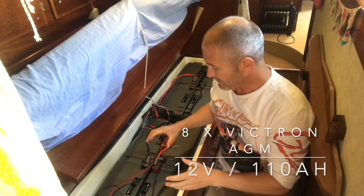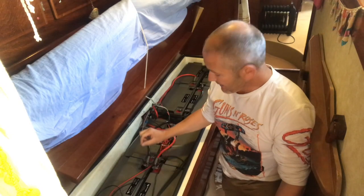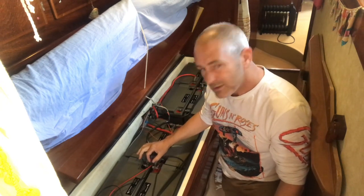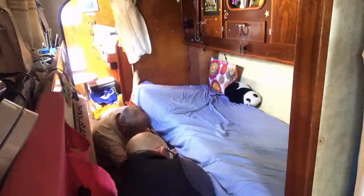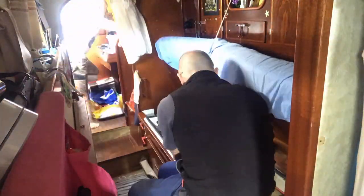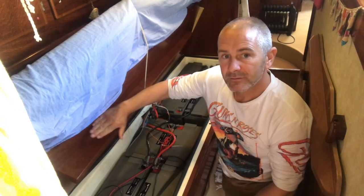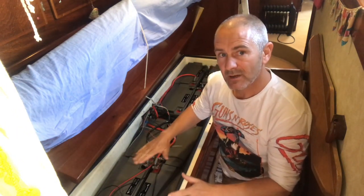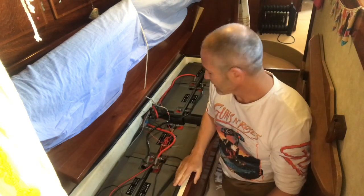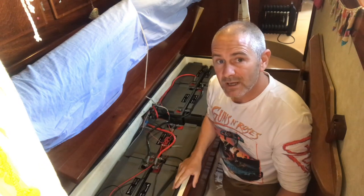But of course what looks good on paper always rubs up against the harsh reality of boat design. We spent about two hours trying to swap these batteries out, putting them in the same way they came out, thinking they were more or less the same dimensions. But they're slightly bigger and the terminals are closer together — only about two centimeters between them — which is not brilliant because if the boat shakes and those terminals arc, we've got a potential fire. Also because of the slight difference in dimensions, some cables were running over the terminals and a reinforcing bar for the bed was forcing cables down onto the terminals, so the whole thing needs to be rethought.